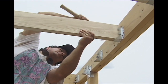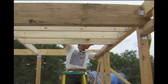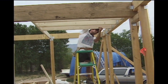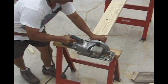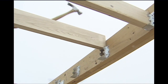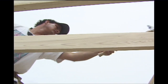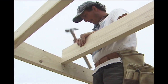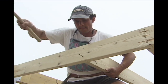2x6 ceiling joists are used in both the entry hall and the kitchen. These joists will be a visual element of the ceiling and also support the floor of the loft. On the south wall, the connection to the beam will be hidden within the straw bale wall, so metal brackets were used on this side for maximum strength. The joist connection on the opposite wall will show, so the joist was nailed in from the other side — still a very strong connection.